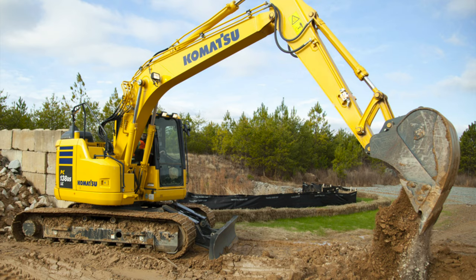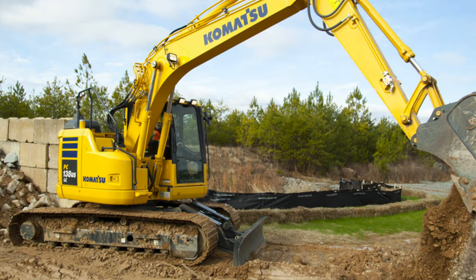However, the PC-88 is a tight tail swing model, which hinders its lifting capabilities to some degree, and it has a swing boom. At that point, it's pretty clear this is a compact machine built for working in tight spaces rather than a true almost mid-sized excavator with more all-around capability. Plus, the jump between the PC-88's weight, engine power, and bucket capacity to what used to be the next model up — the mid-sized PC-138 USLC-11 — is pretty sizable.